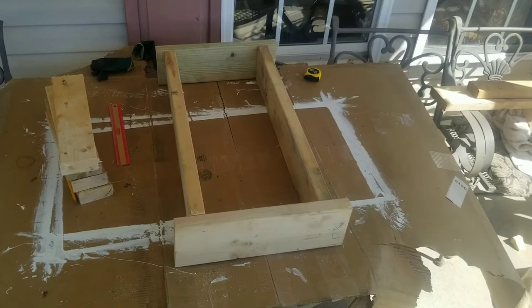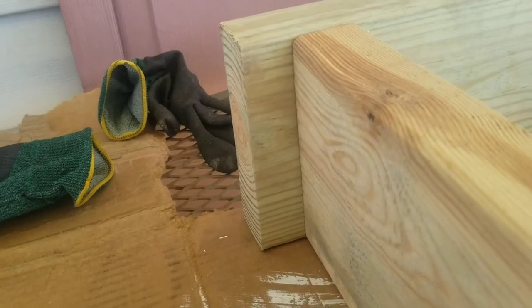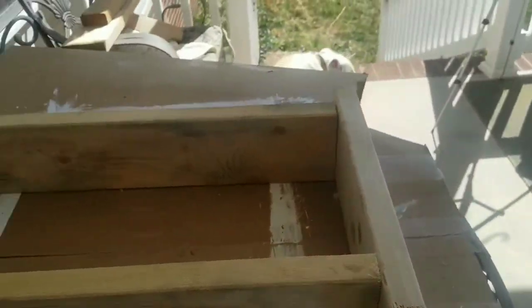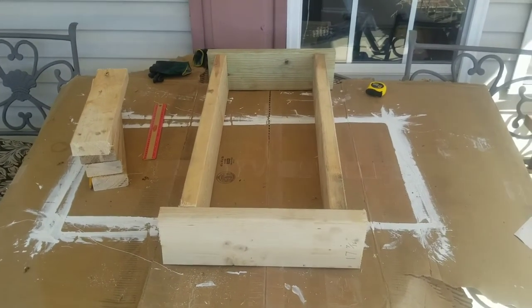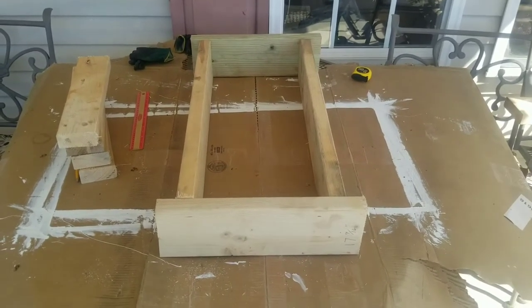This is how we're going to have these 2x6s screwed together. You want precisely an inch and a half sticking out on each side of the smaller piece of wood. And the hive will overhang this stand by a little bit, just so rain doesn't collect on the stand itself. So we're going to go ahead and screw this into place.